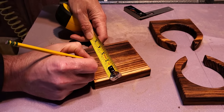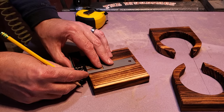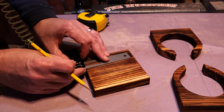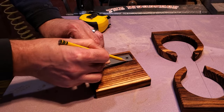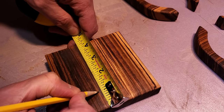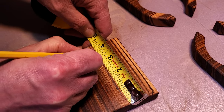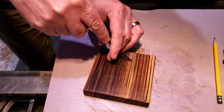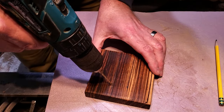To attach it to the base I'm going to drill four holes. I found center on the four and a half inch piece, lined that up, and came in about an inch from each end and marked those out. They're separated just a little bit so the pizza cutter won't fall down through them but will hold up. I pre-drilled everything to make sure it didn't crack, and on the bottom I also countersunk the holes so it sits flat on the counter. You could also add little padded feet so it doesn't slide around — I may get some of those since we use our pizza cutter all the time.